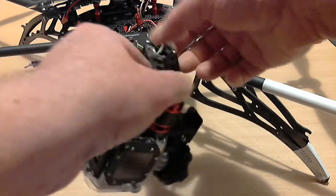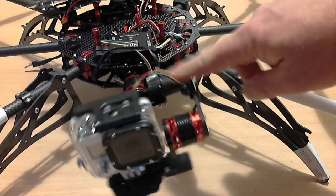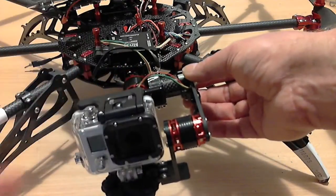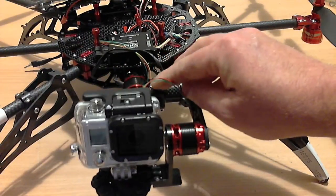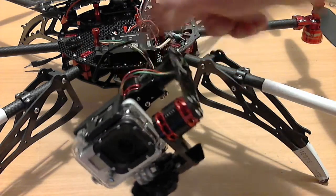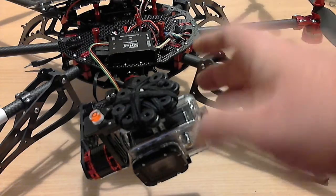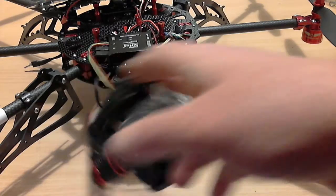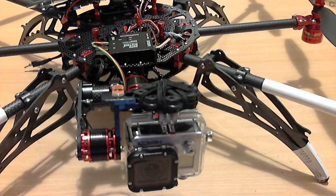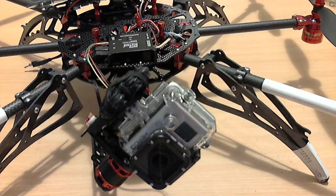With the front motor, I've brought the cable through this slot, taken it down through the tube and brought it out around the bottom. What I found was it was actually causing some drag on the motor. The simple solution I came up with on this particular occasion - and not all gimbals are going to go together the same - was a tiny bit of sticky tape here, just to hold a bend in the wire and have it exiting back along the tube rather than straight out against the motor. Just freed it up with the right kind of loop sitting here. So that's giving me nice freedom of movement and the wire isn't messing with me.